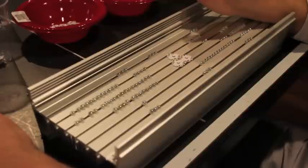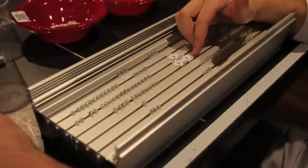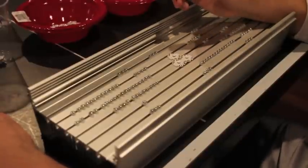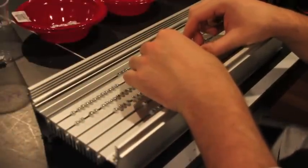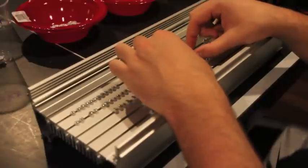But this is an advantage if you're not using a dimmer and you're using colors on just a couple of channels. So let's say you put red and green on your whites — you can put them pretty closely together and so you have less of a disco ball effect. But for the way I'm doing it, since I have multiple channels — 15 channels to be exact — I want them spaced out more so I can deal with the wires.